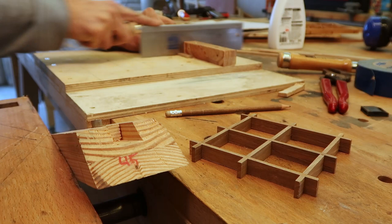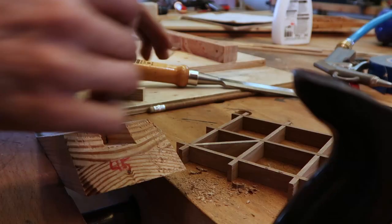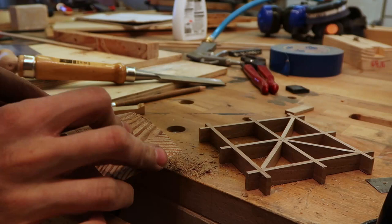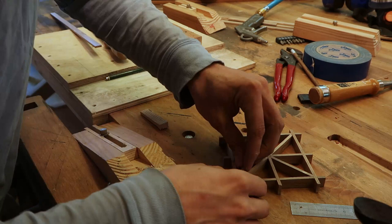There's a lot of back and forth between the 45-degree plane jig and the shooting board. I found the walnut to be not as nice as the cherry to build a kumiko — it tends to split and not leave as nice of an edge, even though I completely reground and resharpened my plane since last time. I used the same thickness strips, around 4mm. There was a bit more fiddling around getting a good fit because the frame wasn't 100% perfect, so I had to custom fit a lot of pieces and couldn't just knock them out one after the next on the jig.